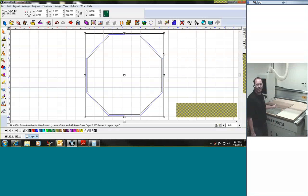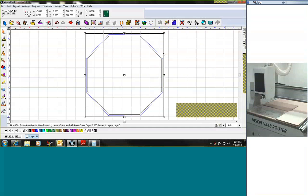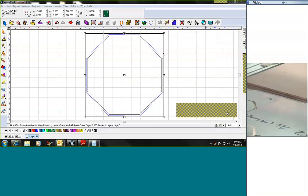But it gives you a better idea of actually watching it cut. So we're going to go ahead and send that over and allow it to cut, and I'm going to change your view so that you can zoom in on the actual piece here. Now that I've changed your view, we're going to go ahead and start this particular job. We're going to cut it in two passes — about 90% of the total piece in the first pass, and then the second pass is what we call an onion skin, which is a very thin cut that decreases the side load on the part and has less chance of moving on the vacuum table as it actually gets cut out. So we're going to go ahead and start this, and in your frame you're going to see the machine come down and make the cut.